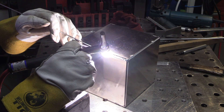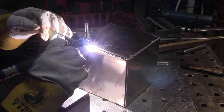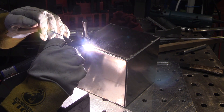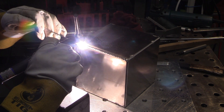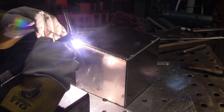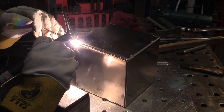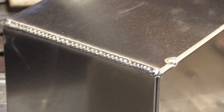Just moving along here, not trying to win any races as far as speed goes — about an eighth of an inch per second. I'm dabbing, trying to dab the same amount of wire every second. This is pretty much my go-to wire feed technique. That's something you really got to practice to get good at welding aluminum — you've got to get that filler rod hand up to speed, because you feed so much more aluminum than you would steel. It just goes into the puddle like butter.